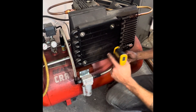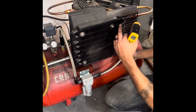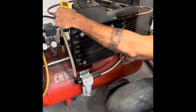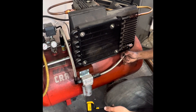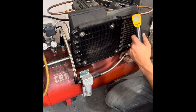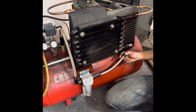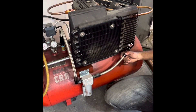I've seen people put a little electric fan right here — like a computer fan or something on 220-volt — wired into the compressor contacts for auxiliary cooling. I don't think that's really necessary. The only thing I have to do, because I use this thing basically wide open when I do sandblasting, is cool down that compressor motor, because it trips the thermal overload very quickly. Let me know what you think — I'm going to link the stuff in the description.